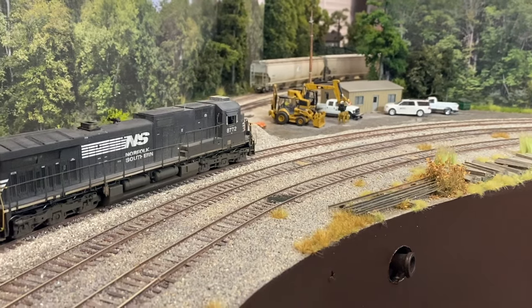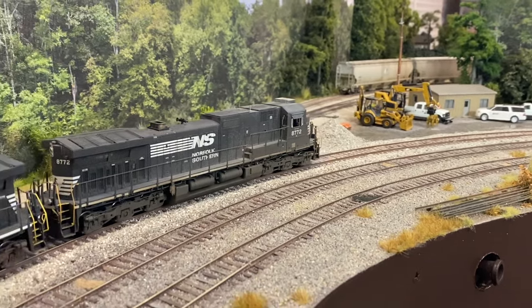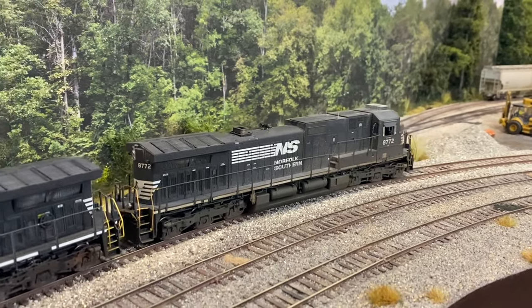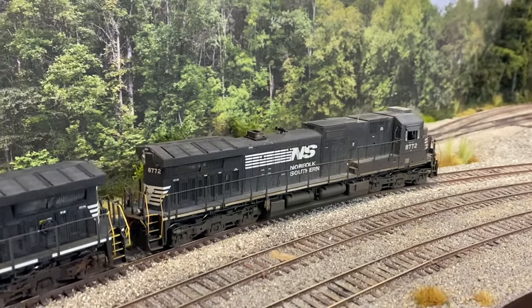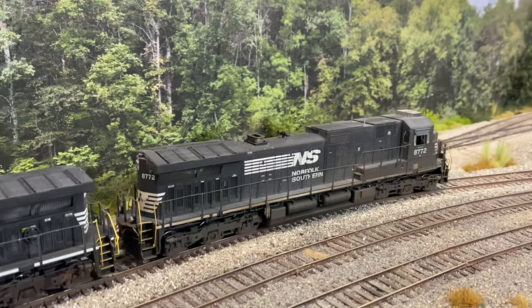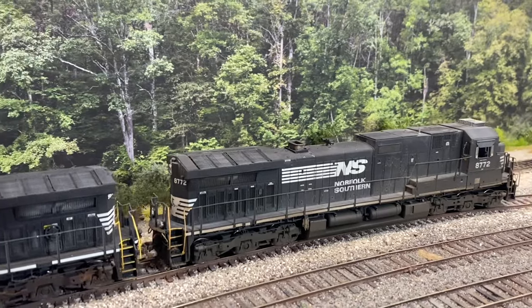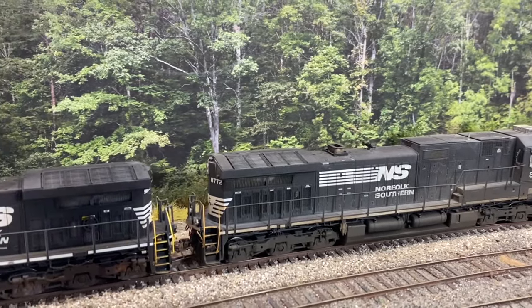Dynamic brakes can produce a lot of energy, and in the future will be used to recharge battery-operated locomotives that are consisted with traditional units. On traditional units, all this heat and energy is expelled into the atmosphere through the grates and the fans on tops and sides of the locomotive.